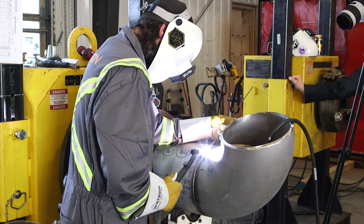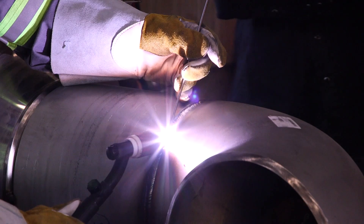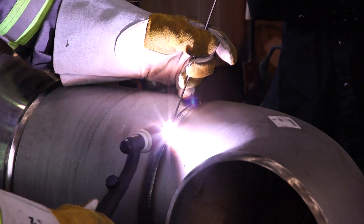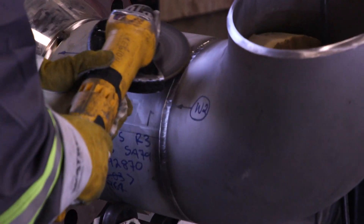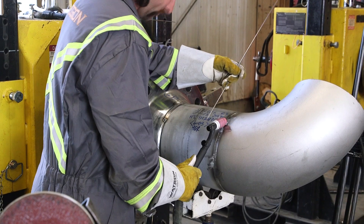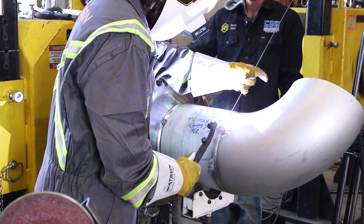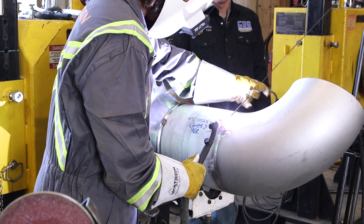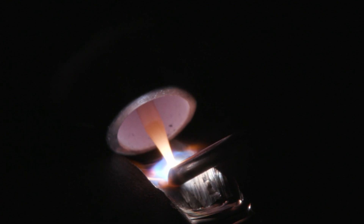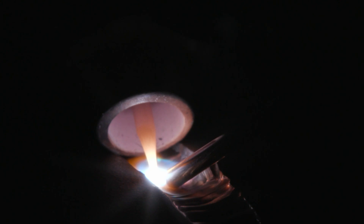Walking the cup offers a very robotic movement. One of the things at Leeds is that all the welders — even in the skill proficiency test — need to learn how to walk the cup on the root pass, filling and capping. Even on a two-inch schedule 40 carbon steel pipe, we still walk the cup on the root, even though it's a position weld. It's all to do with aesthetics, production, and it's more robotic — it offers a higher quality weld, less voids, less defects, a very constant continual movement.